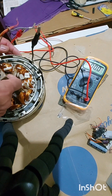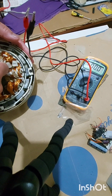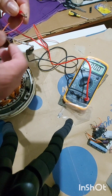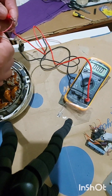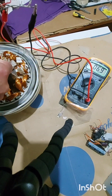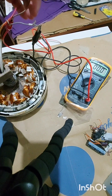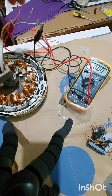Have a look at how much each phase produces. Phase one is about 1.2 volts — very low. Phase two is 5 volts, 5.3. And the other one, phase three — 6.8 volts, very high. This phase one, the brown one — I made a little mistake when winding. I think I wound it the opposite way, that's why the voltage is not coming out properly.